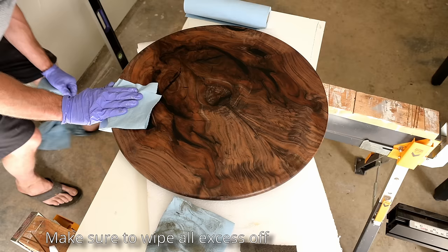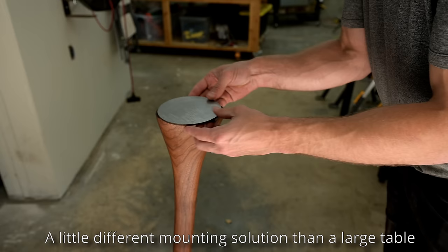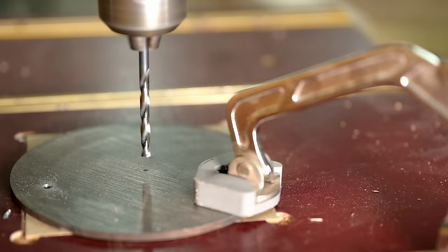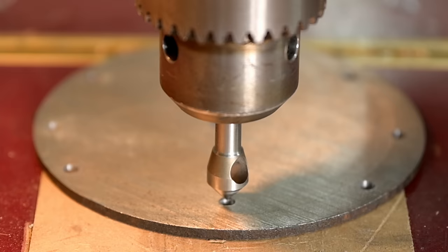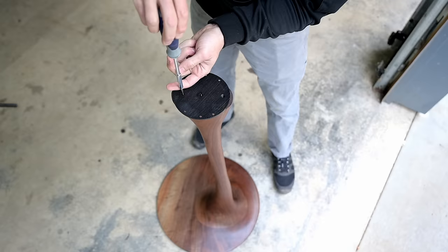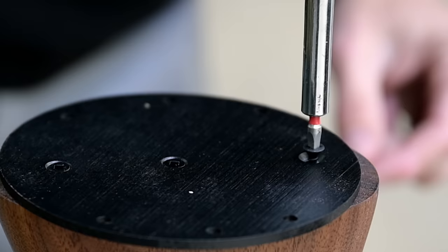When it comes to mounting these tops to the bases I have to be a little creative, because I don't always know that this top is going to stick with this base forever. I've sourced these metal discs pre-cut on eBay — they're eighth-inch thick — and I drill a few holes in them. This allows me the flexibility to move them around from tabletop to tabletop. The downside is that you have to use screws, and I don't love using screws. I do prefer threaded inserts and bolts whenever possible, but for these small tabletops the screws are going to be just fine. I drilled the holes in the appropriate pattern, added countersinks so the table sits flush, then added some number-eight wood screws for a simple and quite secure mounting system.